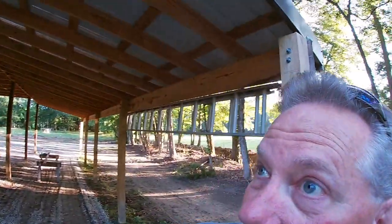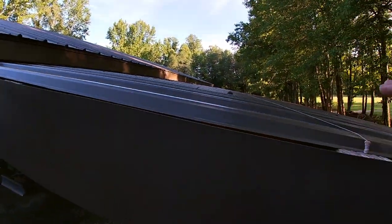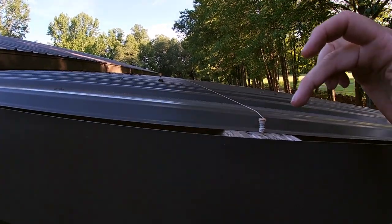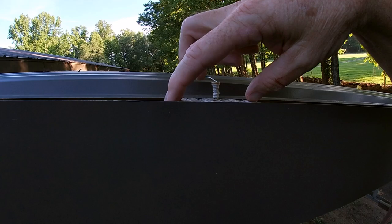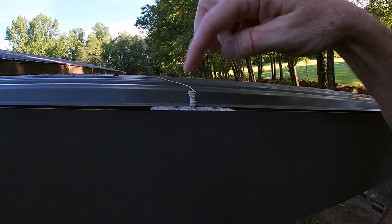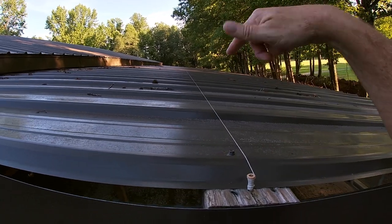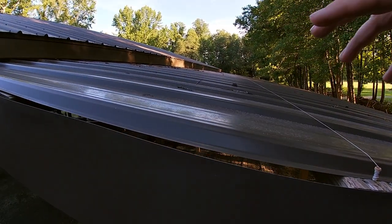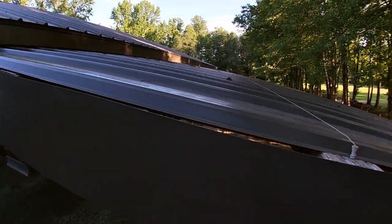Today I'm going to get back to finishing up this metal project. I have got the trim on except for the corner pieces. I haven't put them on purpose yet because I need access to my stringers. On these stringers I run a screw down, I set up a guideline so I can make a nice pretty row, and I've got three more rows of screws to put in here before I put on the corner mold and tie it all together and finish it up.